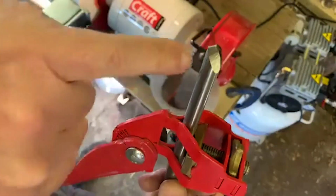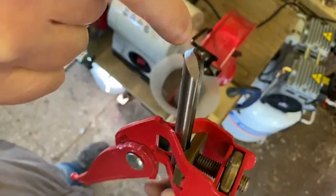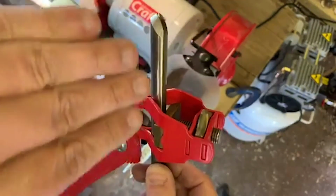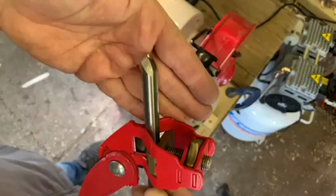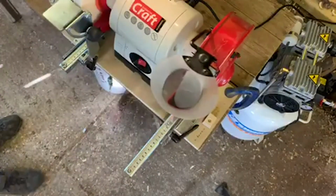Now, what I've got to be careful of when you're sharpening is that you're not producing any hooks. I just noticed a little hook coming here. You never want to hook the front and the back. You want to have either a straight or very, very slight convex there to make it ideal in use. But there again, single facet, ever so quick. No heat because of the CBN.